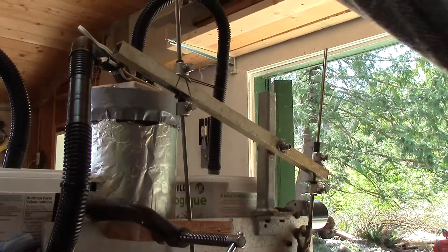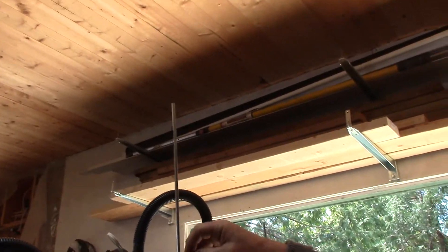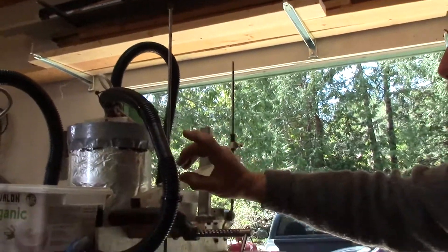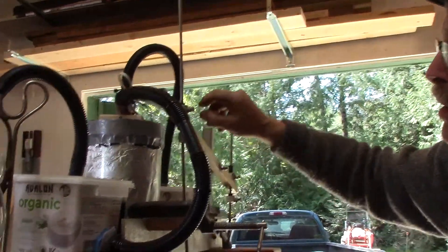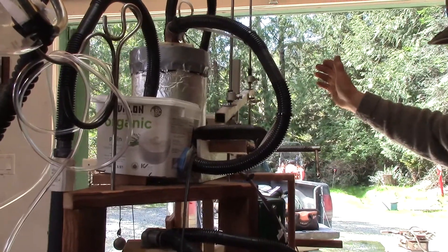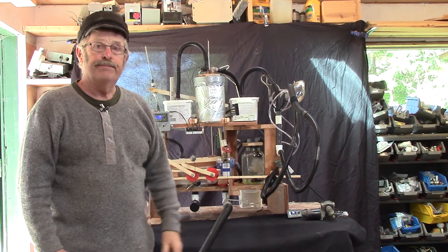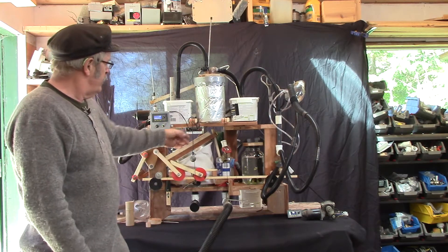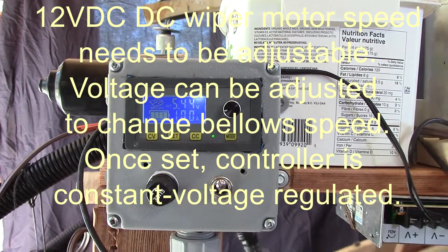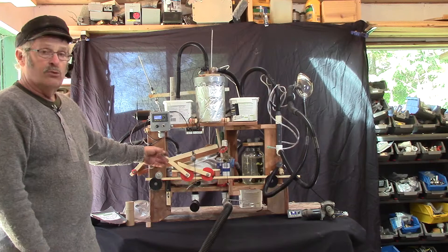When I first had this, these little bits of rubber — quarter inch outboard gas line — I just had a twist of haywire around them, and that worked fairly well. But they did tend to creep a little bit, so I cut sections of three-quarter inch aluminum pipe, drilled and tapped them, and put a bolt on them. This is just aluminum that was laying around; you can hook it up any way you need to. Was built for about $20. The control mechanisms were about $140 or $150. The rest of it is wood and screws.